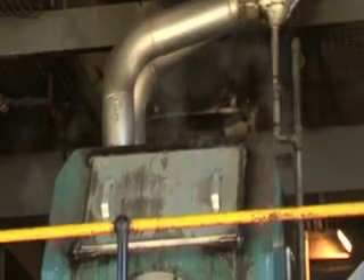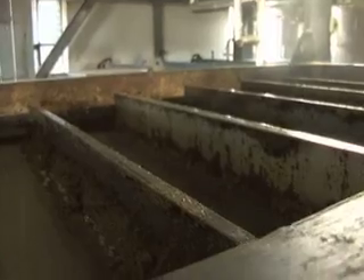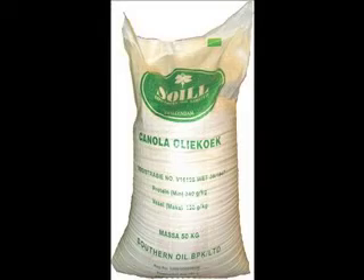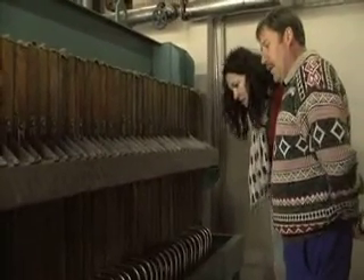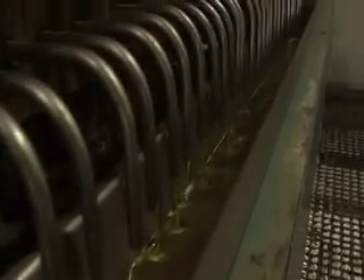The press is a screw press. At this stage we press out most of the oil, and there is still about 16% of oil left in the product, which is called oil cake, which is then fed to the extraction plant. The oil that came out of the press is filtered through a screening stand firstly, then through a press filter, and then pumped into the crude oil storage tanks.